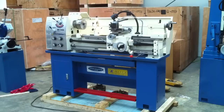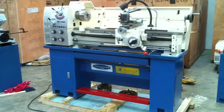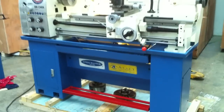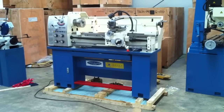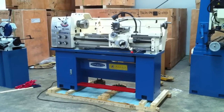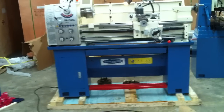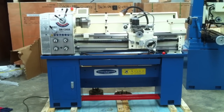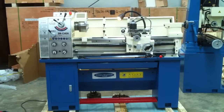With all the features supplied with this lathe — fixed and travelling steadies, face plates, cam lock, three-jaw chucks, four-jaw chucks, dead centres, covered lead screws, quick change tool posts — this will be one of the best-packed and best-value lathes on the market. Both metric and imperial calibrations are included for ease of use. Our 1340A, as the model indicates, is 13 inches swing over the bed and 40 inches between centres, which is one metre.